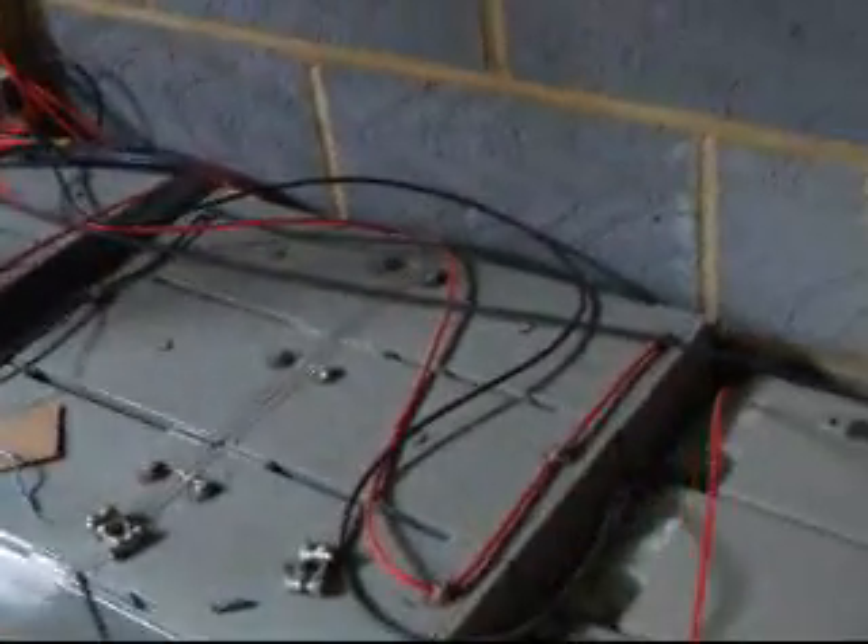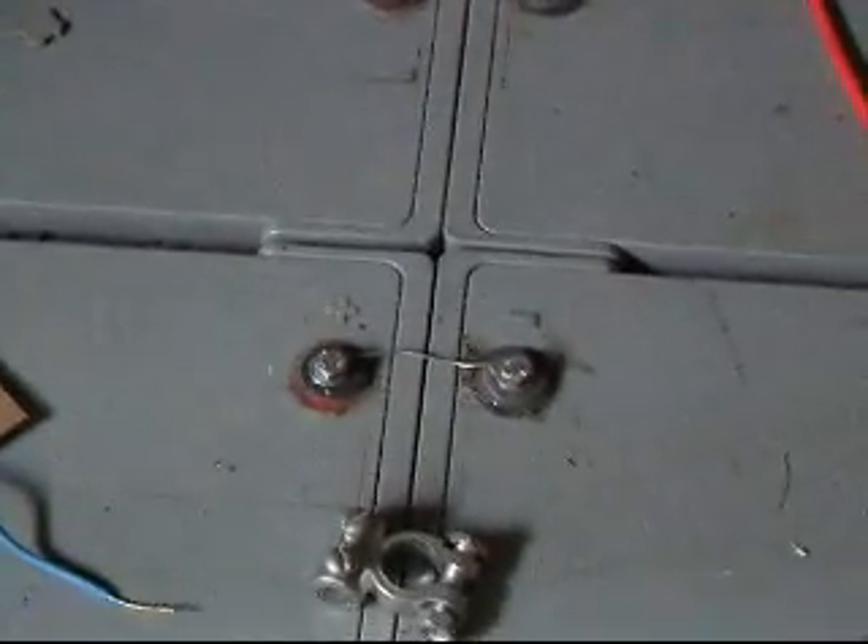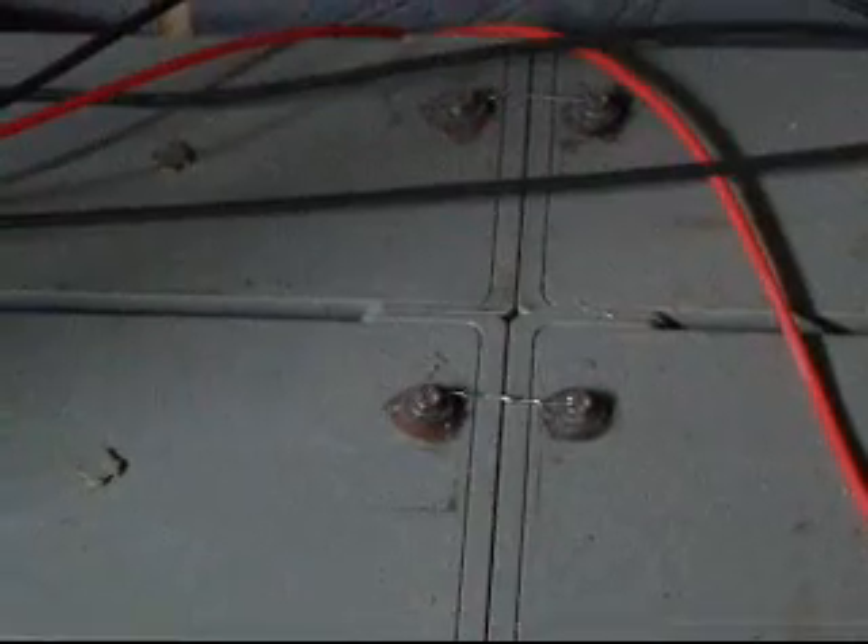The main system in use is at 24 volts. We've got sets of batteries connected together in series. Those of you who have watched my previous video will know that I'm using solder wire between the batteries as a fuse, so that no pair of batteries can give more than 7 amps. Temporarily, I've got these brown and blue mains wires setting up each set of batteries — which will be 24 volts — wired in as 12 volts, so that I can put desulfators on them and charge them all to the same amount, so that they all work equally.